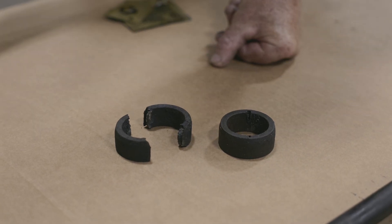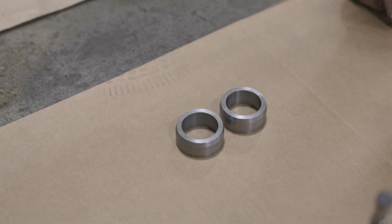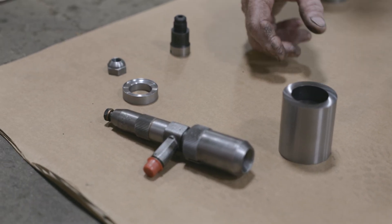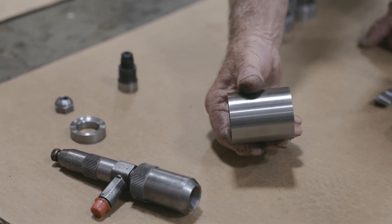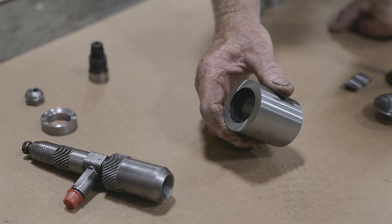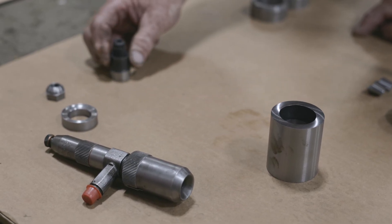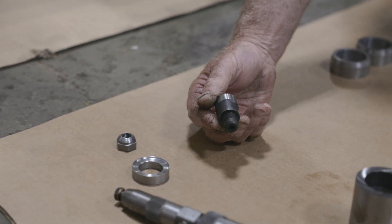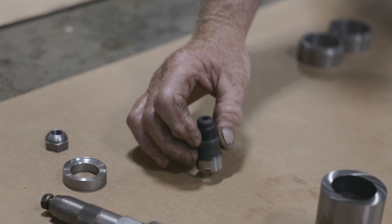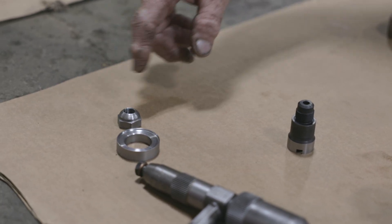When we got into the heads, we got our injectors done. They call this part a cage, which goes into the head, and you have water that comes up to the outside of it to cool everything. There's a chamfer in here to fit — we had to have these manufactured. Then where the injector sprays into the head there's a piece threaded into the bottom called a burner tube — we had to have those made as well. To hold the injectors in place, these rings had to be made along with the hardware — two per injector.